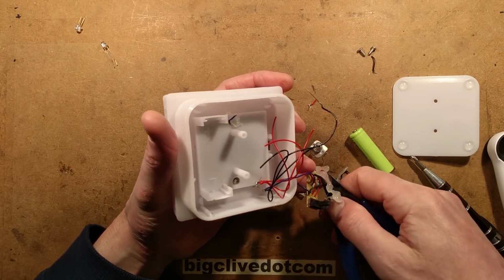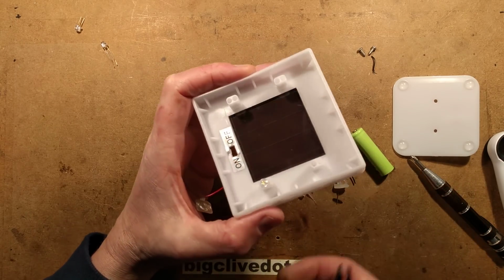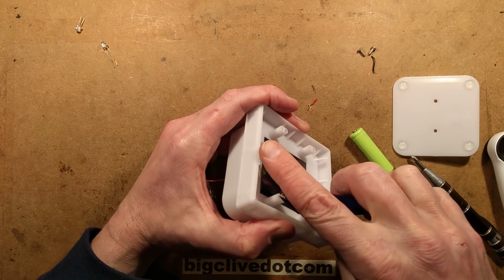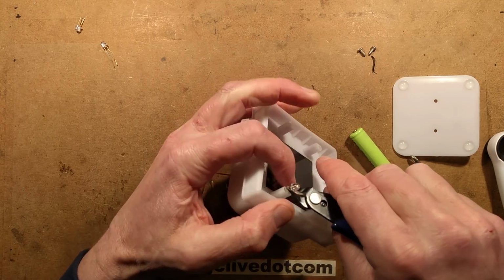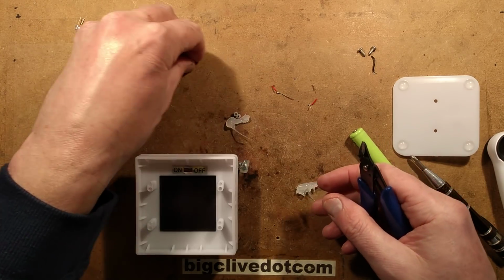So the simplest charger in these circuits, inside that little 4-pin chip, is a diode, and it basically just allows the current to flow from the solar panel into the nickel metal hydride cell, but stops it discharging when it's in the dark.